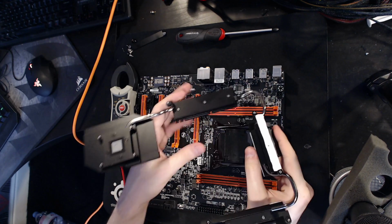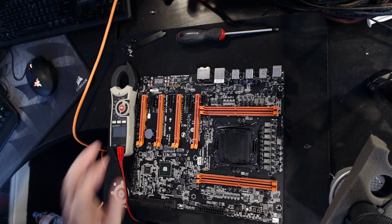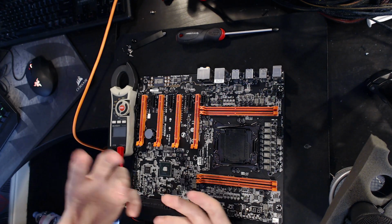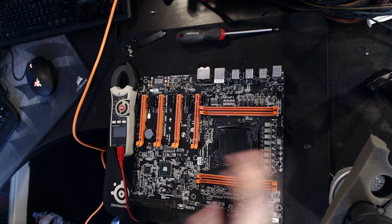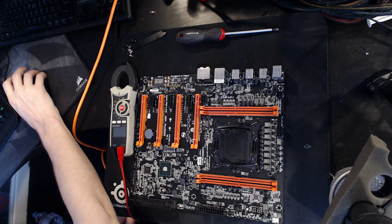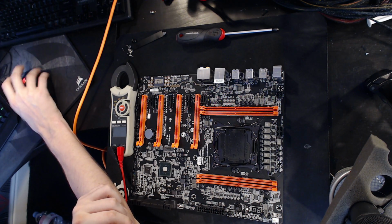Ultimately, you'll only be seeing that kind of heat output on liquid nitrogen. On air cooling and water cooling, you can still get Haswell-E and Broadwell-E into that 400 watt load range. Beyond that, they become basically impossible to cool as far as I'm concerned. So there you'd be looking at closer to around 200 amps and a reduction in power consumption, which obviously means a reduction in heat output on the VRM, which I didn't do the math for yet, so let me quickly get those calculations up.